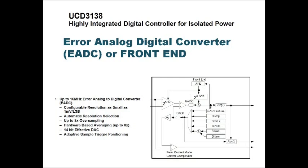Let's talk about the features of the UCD3138. If you take a look at the datasheet, you can see that there are three front ends available for this device. They refer to them as error analog-to-digital converters, or EADC blocks. These can be configured with different analog gains, which will give you up to 1 mV per bit of resolution. Each of these EADC blocks has a 14-bit DAC as a reference, and this DAC can be set from various sources within the UCD chip — for example, a ramp for soft start, another block's filter output, or just a direct programmed value. There are several selections available for the DAC reference value.